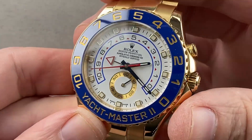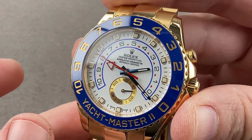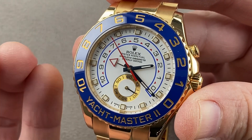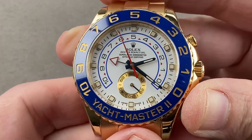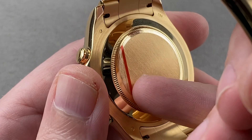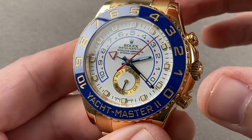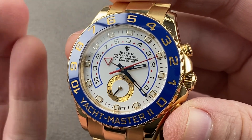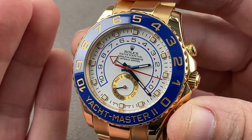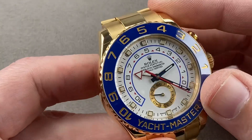It is a COSC-certified chronometer, but Rolex takes that COSC movement and then retests it in the case in six positions so that it runs no worse than minus two to plus two seconds per day — that's the basis in modern history for the term superlative chronometer. The movement beats at 28,800 vibrations per hour and is braced against shock not just with the rotor bearing, but with a full balance bridge and a free-sprung balance. The watch also includes a niobium-zirconium blue-oxidized anti-magnetic hairspring that Rolex calls Parachrom Blue, very resistant to both static and electromagnets. That hairspring is handmade with an overcoil profile — a Breguet overcoil — so the watch keeps even time in any orientation with respect to gravity.